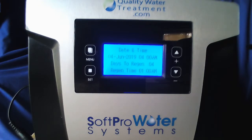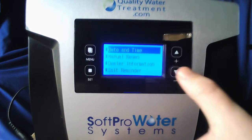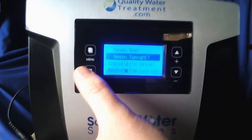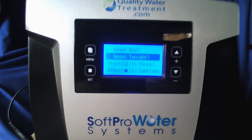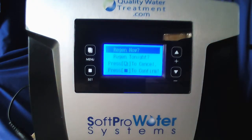To do a manual regeneration, you'll have to unlock your valve if you've been away from it for a few minutes by holding the menu key until it beeps. Once your valve is unlocked, tap the menu key once. Scroll down to manual regeneration — when that's highlighted hit set. It'll say regen tonight and regen now above it. Use the up arrow to highlight regen now and hit set, and that'll start a regeneration. Do that once a day for the first four days. The Catalox media is very fine so it helps clean it out, and then every four days after that should be good to go.